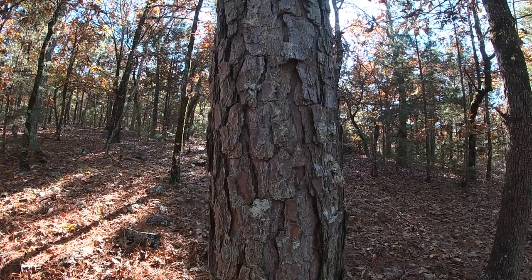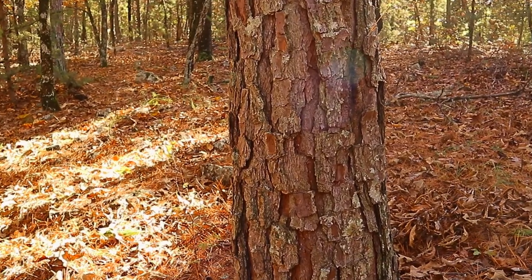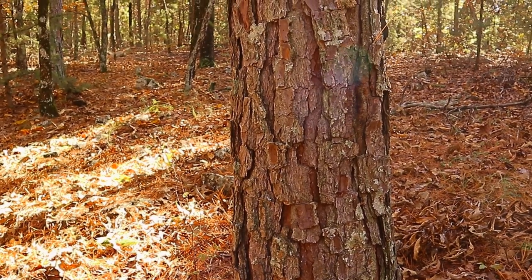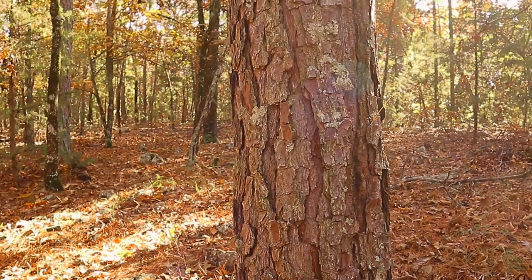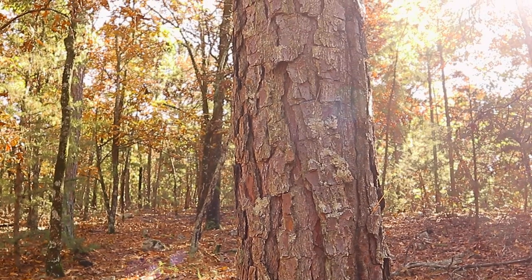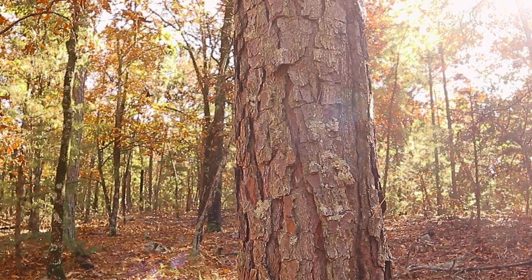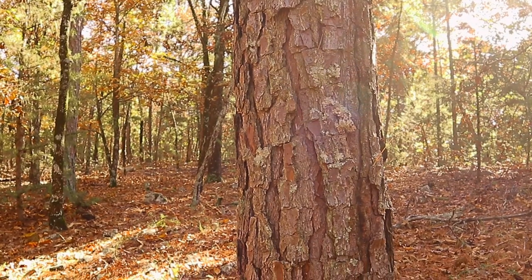When you're hewing on the top of the log, if you run across a tree with bark twisting to the left, I'd leave it because it might cause you problems. It could safely be sawed into thinner lumber pieces where it could be more easily contained, but when you're trying to get a timber or wall log out of a tree, you want something that's going to stay fairly stable.